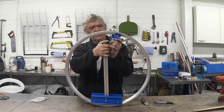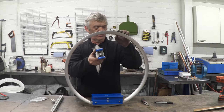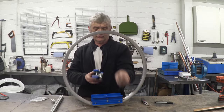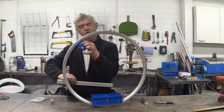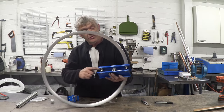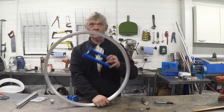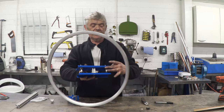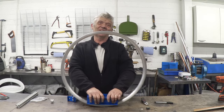I've left this loose so I can take it out really easily to show you how it's made, and it's made really simply. This is just a carriage holding a couple of roller bearings. You buy these online — they're roller bearings covered in nylon tyres, that's all they are. It's a single carriage doing that job. This carriage is two of those roller bearings on the bottom, on a screw, held apart with nylon washers in an iron frame. I cut two bits of iron, four of those tyre bearings on a bit of rigid frame, pop it on there, and you're off. That's all you actually need to do on something like a bicycle.